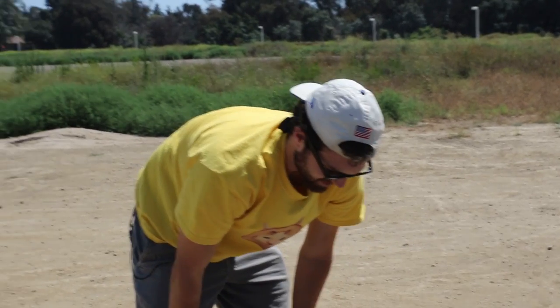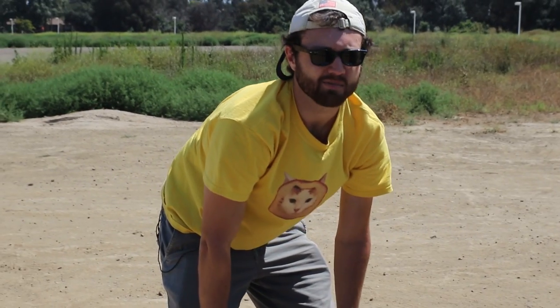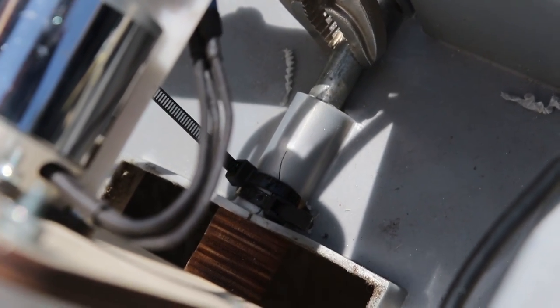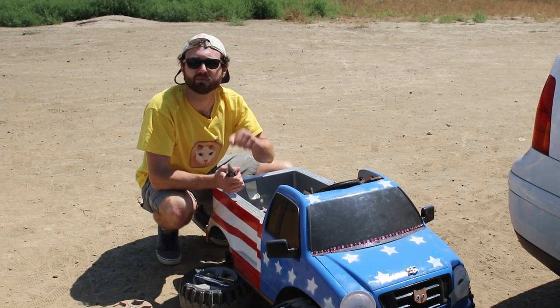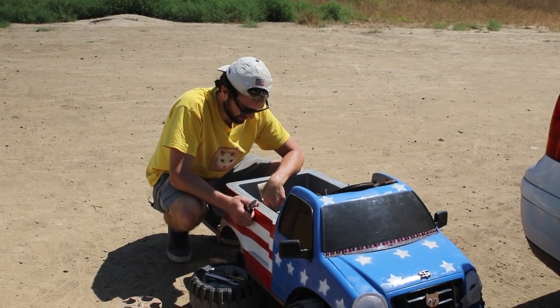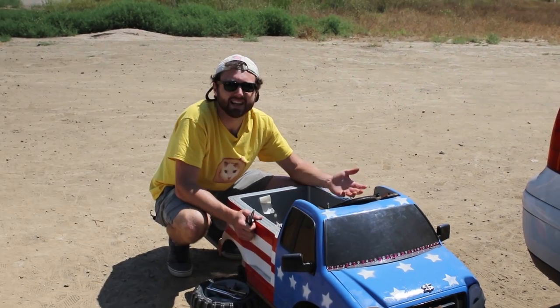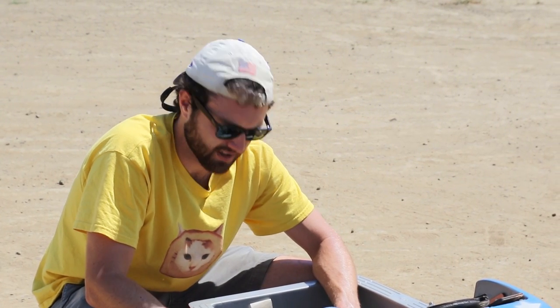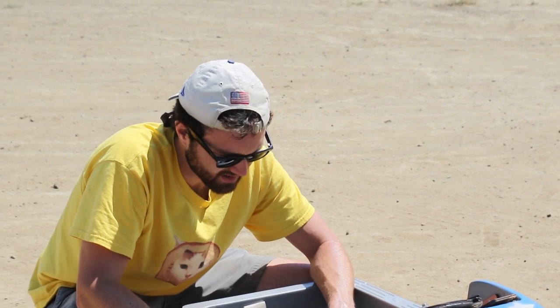Having some problems. And you might be thinking, what kind of problems, William? The answer is all the problems. There's a crack in the shaft mount here, and that's allowing the wheel and the motor to compress together, which makes the belt slip. The motor's getting hot, which is warming up the coupling to the encoder, which is heating the motor even more since it's running less efficiently, and then it progressively gets worse. And then the firmware issue is something Oscar's still working on, which is motor one doesn't behave nearly as well as motor zero. It sort of does these weird humming things.